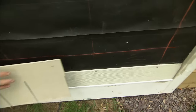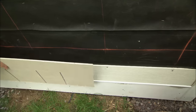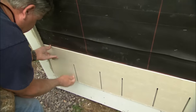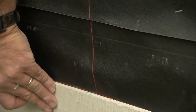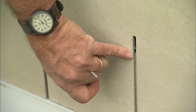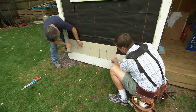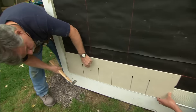I also want our shingle to end up on this stud right here, so I cut that to length. Now we're ready to put the first shingle on. I'll space it away from the trim about an eighth of an inch, then nail it so it's on the line. With my shingle in position, I nail into the stud, following that line down to about the top of our filler strip, and nail right into the filler strip. If I nail up too high there's a void, and I run the risk of breaking the shingle.